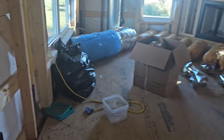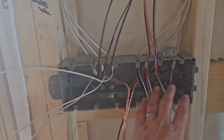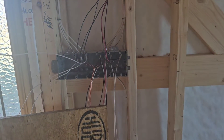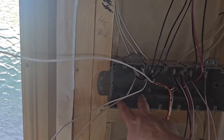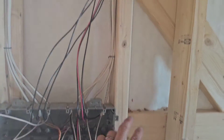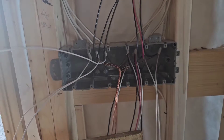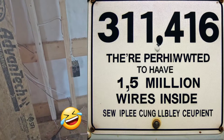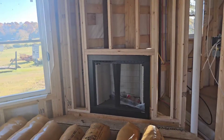I wanted to stop and show you guys this — it's a six-gang box purchased off Amazon. Always make sure all of your things that are required to be listed are UL listed if you get them from Amazon. This one's really neat: it has dividers if you want to divide out the low voltage. I'm sure he had to put a special stud there just for it. It's going to be fine on box fill. Then we're going to start from this wall and have an outlet every six feet and every 12 feet after that. Looks like he's got good spacing coming on around.